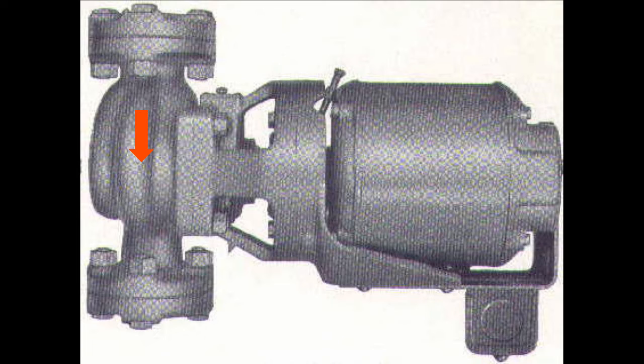And also, with the building boom that takes place in the 1950s, we begin to see the development of packaged boilers. The packaged boiler has the controls attached to it and the circulator as well. And the nice thing about that, if you're a contractor, is it's easier to install because everything is all put together. And the boiler manufacturers are getting a great deal on these circulators because the people that make the circulators almost give them away to the boiler manufacturers, figuring that down the road, when the circulator fails as time goes by, and it'll probably fail many times, it's going to be replaced with the same circulator. So they want to get in there first.